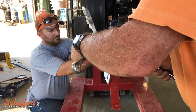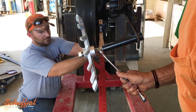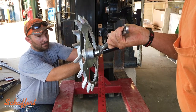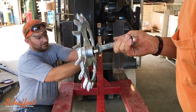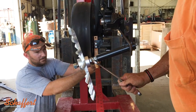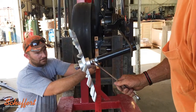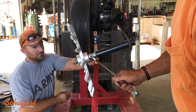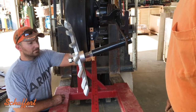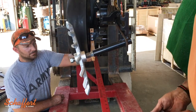I'm going to re-pitch this for you — hold it back like that to show how it was going before. That's about the distance it was before. So you can see by turning this eccentric we can even come in closer — we're actually over the furrow. Come back to a happy medium here. The farmer is going to have to adjust it to his specifications: how much dirt he wants to put in the furrow.